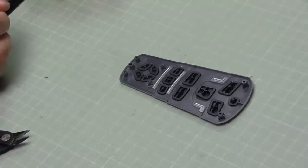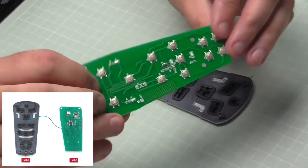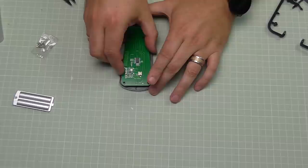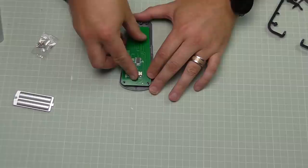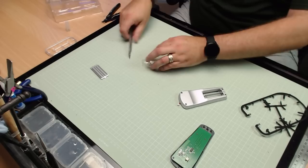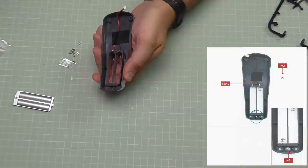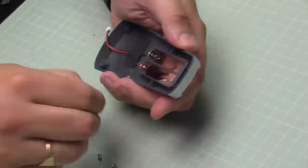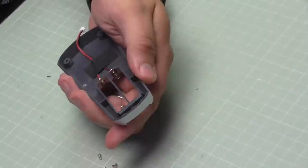On the back we're going to put the circuit board — it keeps all the buttons in place. It goes over the lugs on the remote control, just like that. Then open up these screws because we want a nut in here — you can see the little hexagonal shape. Drop a tiny bit of glue just around the edges, not too much, and put a nut into that section. Put it down nice and flat in there.